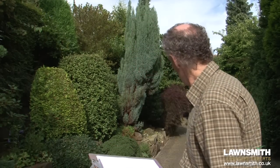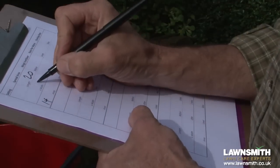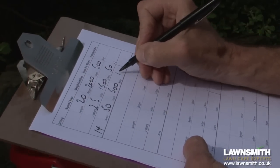We started off with a setting on the spreader of number 14. The length of spread was 10 meters; we did that twice, so that's 20 meters, and we established it was two and a half meters wide. Multiply the two together and that gives 50 square meters. The weight of fertilizer when we started was two kilos — 2,000 grams — and when we finished we ended up with one and a half kilos, 1,500 grams. That means the amount used is 500 grams. So to get the rate per square meter: 500 grams divided by 50 square meters gives 10 grams per square meter.